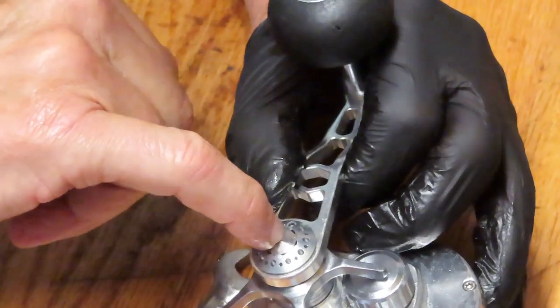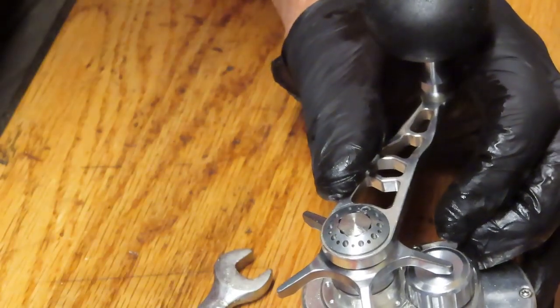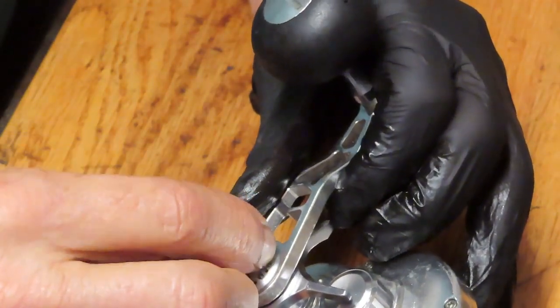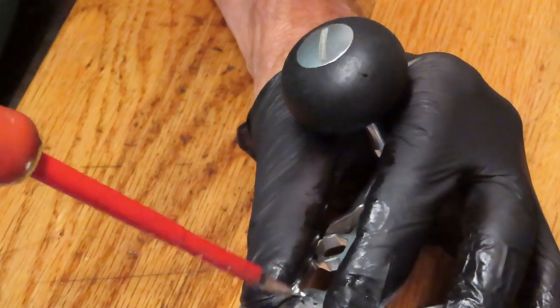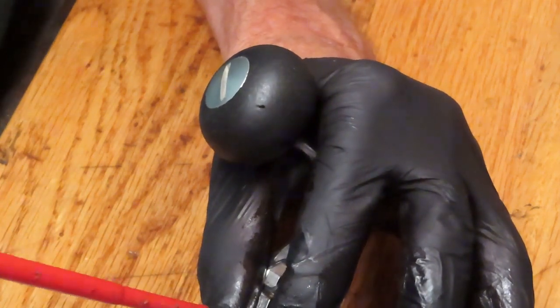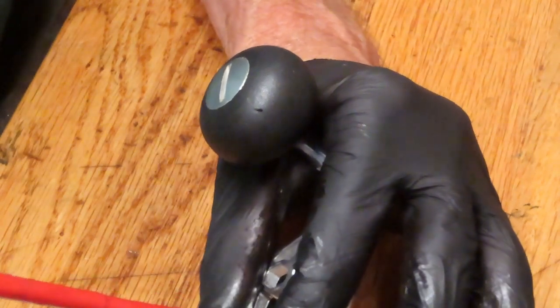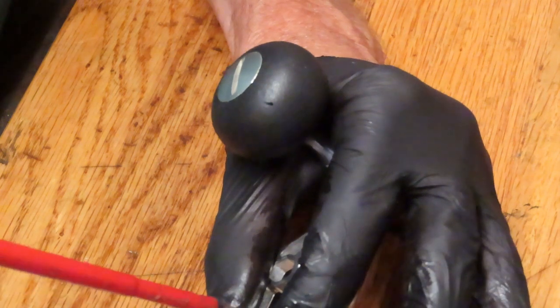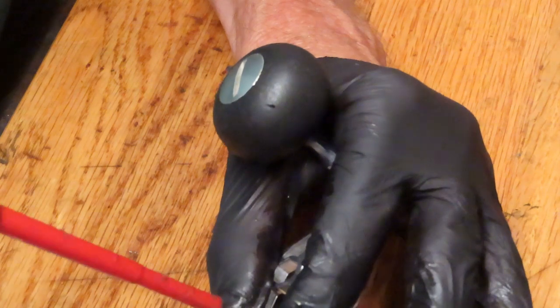We have the cap that goes next. Point the tip of the screw to the hole and that will generally line it up. Then we have that little tie-down screw that goes into the hole — this one was quite an issue coming out, hopefully it won't be going back in. I'll put a drop of oil on that to facilitate it going back in. It's all the same issue here — just a lot of bad dirt, grease, and debris. There we go — tie-down is in.